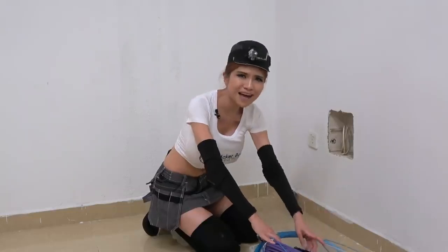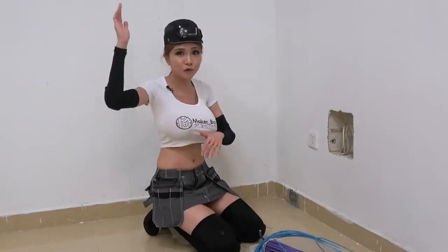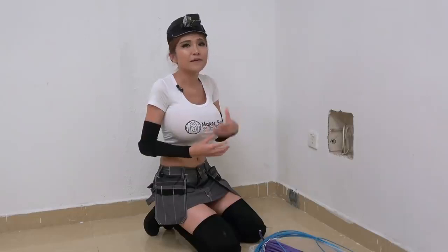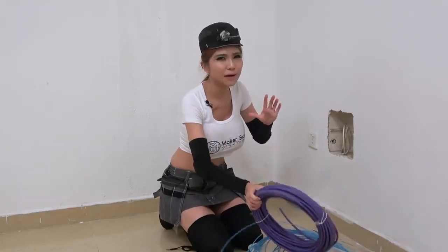I normally run CAT5 but I know you'll probably complain, so for this occasion I'm running CAT6E as the backbone between the access points on the first to third floor. The third floor access point should have enough signal strength to cover the fourth floor, but if not I'll wait and get another router later. I need to be careful with spending and only fix a little at a time — right now I have air conditioning in two rooms and no hot water; I'll fix that bit by bit. My past two apartments had good conduit in the walls and I like having a hardwired network for transferring video files faster, so I've done this a few times. The CAT6E is pretty heavy stuff and I'm a little worried about getting it through the conduit rack, but let's get started.